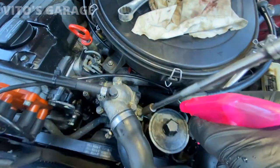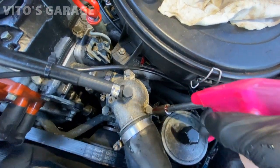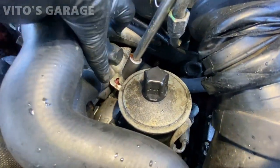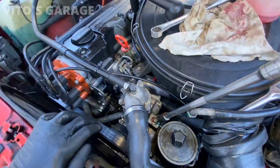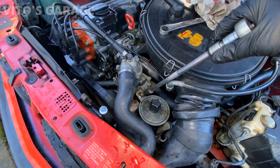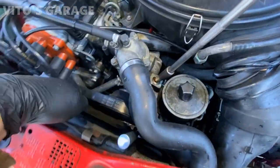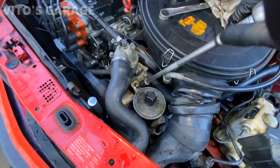I have my ATF and I'm going to drop some oil on there. It's a good idea to actually go even deeper and spread it all the way down there, then just let it sit for a little bit. Once you're ready, start tightening your belt carefully, clockwise, to tighten it. Make sure that 19mm bolt gets loose before you tighten this tensioner rod.